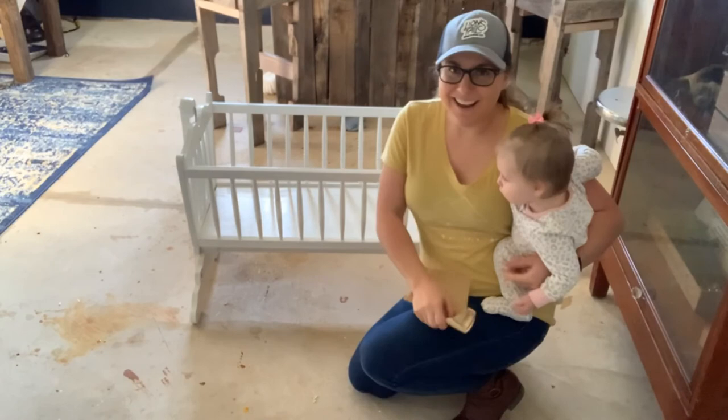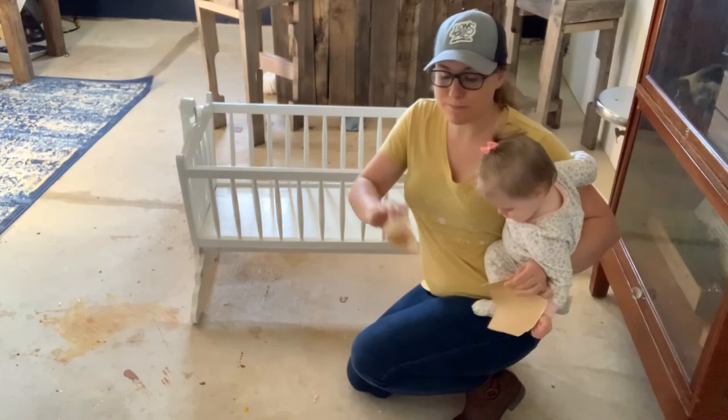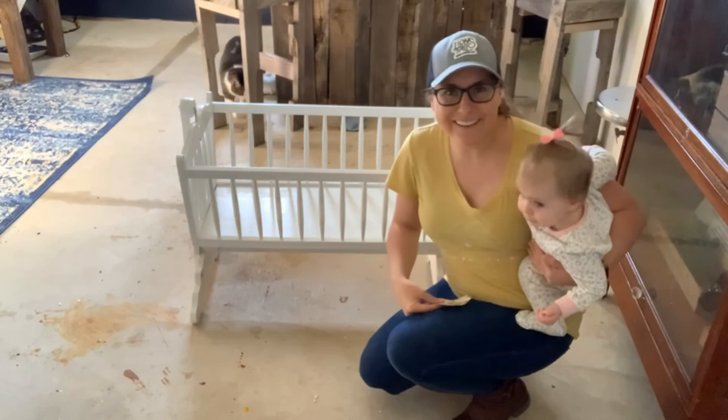This is all dried — I've got two layers of paint and a coat of primer and it is gorgeous. Because I like that farmhouse feel, I'm going to get some small pieces of sandpaper and distress it in the places that would naturally get worn: a lot of the edges, some of the front spindles, and the corners.